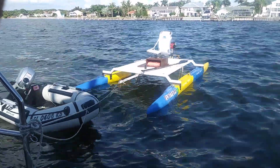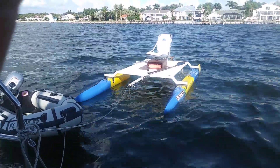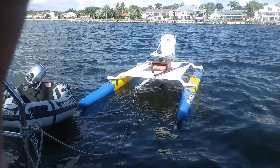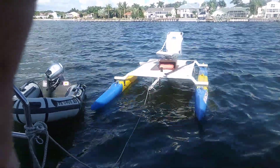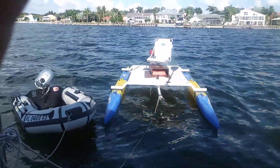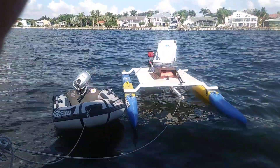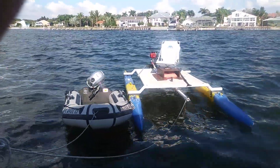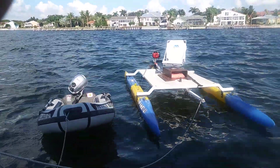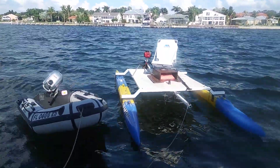I'm just going to tell you a little about the boat. We did some modifications since the last test in the water. Because this is a sailboat and it has a rudder, I went and put the sailboat rudder on it. It steers so much better with a rudder. I just locked the motor in the forward position, and there's far less cavitation when you're going forward at seven miles an hour — this little one-and-a-half horsepower can push it six to seven miles an hour.